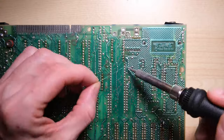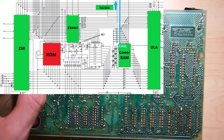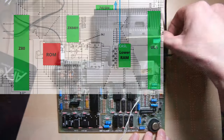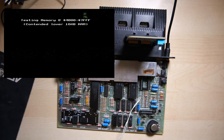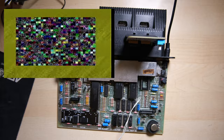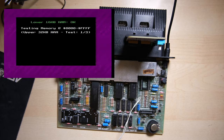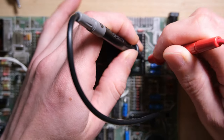While I was re-flowing the solder joints - which didn't work by the way - I did have a thought. What if I removed the ROM chip entirely and ran a diagnostic ROM from the edge connector? This should eliminate any funny business with the ROM socket and the ROM chip itself. And hey look, it's working - look at those beautiful colours. I've never been so happy to see them. Trying really hard to ignore the fact that I didn't need to remove all of those lower RAM chips - let's continue with some continuity testing around the ROM chip socket, because there's clearly something going on.